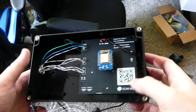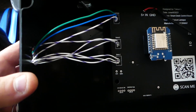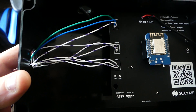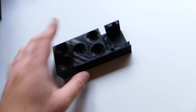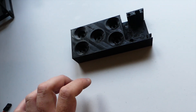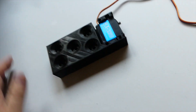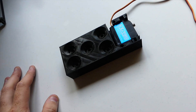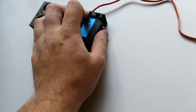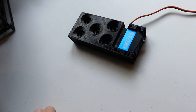I took the PCB and got it all soldered up and connected all the wires to everything. I also put it inside the case I'm going to be using. The lid isn't on, but this whole thing will have all the wires coming out and will be attached to the bottom of the desk. I've got a 3D print here — I expanded it a little bit on the side and gave it extra mounting holes for extra strength. You take a servo motor, it sticks in there, a little adhesive to attach it, the paddle goes onto the side, and this whole thing mounts under where the monitor is and should be able to spin it and lift it up.